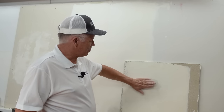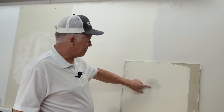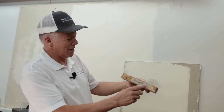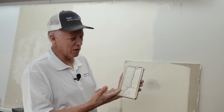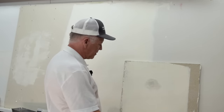Then I know I've got just a few more minutes until it may start setting up. This one isn't rock solid yet but it's firm enough to go over. I guarantee it's not going to shrink up anymore — that's the nature of hot mud, as you saw with that sample. I noticed I've got another one mocked up here — I was going to put mesh tape over this but didn't. This is all-purpose that was allowed to dry, and you can see it dries terribly. The hot mud dries totally smooth and ready to go.